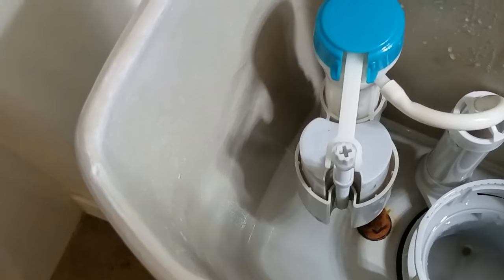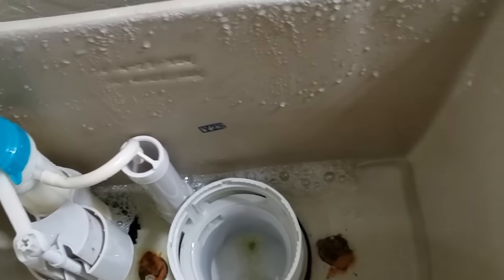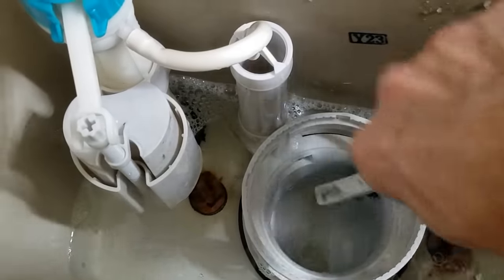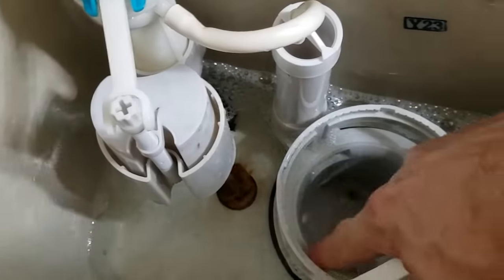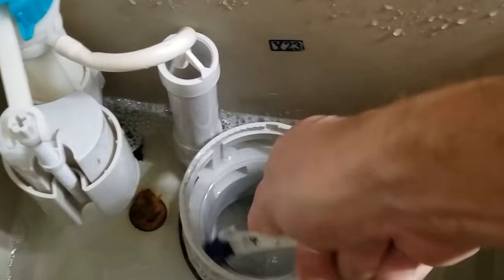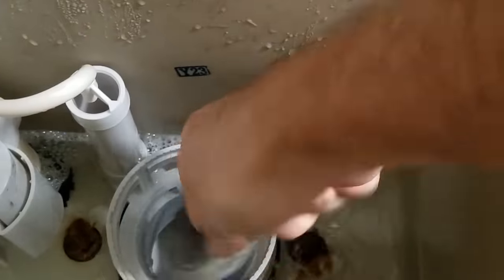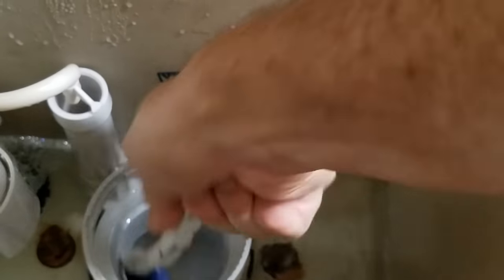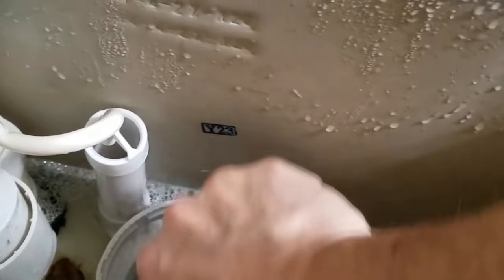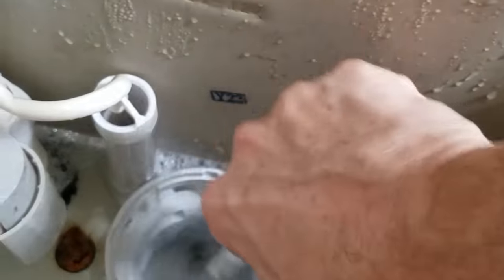If I've got calcium on the plunger, it's more than likely I've got problems in the bowl too. I'm going to put a couple of cups of CLR down into the bowl. If you've got a calcium obstruction in there, it's going to start loosening that up. Use your finger along this edge where the plunger sits — if there's calcium on there, that's probably causing your leaks. Brush it all out nice and smooth. If you've got calcium from the top of the bowl down to the valve seat, that's where you want to apply CLR and brush.